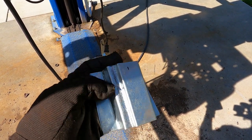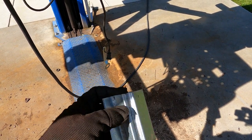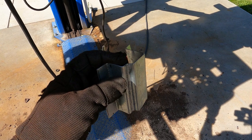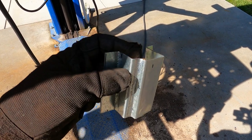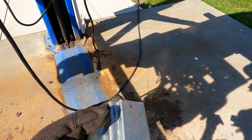You can put your first bend in with the brake, but after that I'm using the vise. I have a piece of quarter-inch plate steel so I can put it in the vise with a little bit sticking up, slide the plate steel underneath, and use that to leverage.